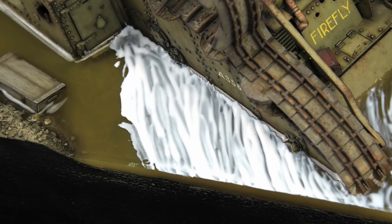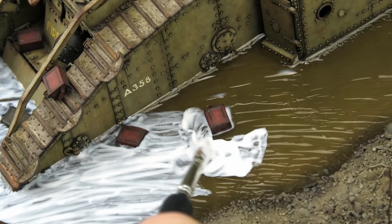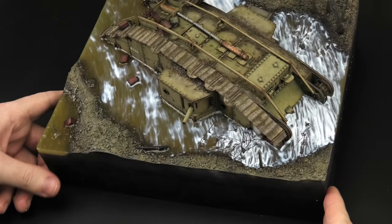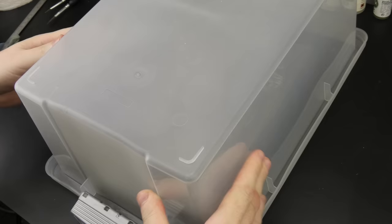I was especially concerned with some very obvious brushstrokes on the surface, so I decided to give it another layer. Once again, I applied it in the same manner, but this time I was more focused on fixing the ugly areas, because most of the texture was already there. The thicker the gel is, the longer it takes to fully cure. Most of it was becoming translucent by the point I was done, but a few spots would definitely take a while. So I just set it aside for the third and final time.